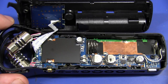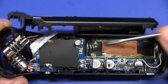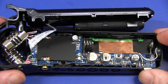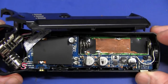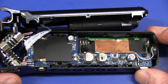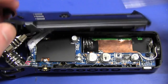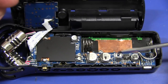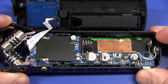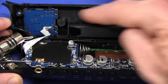Now that's rather interesting. The first thing I notice is this copper shield on top of this board. It's soldered at a couple of points down in there. We've got a flat flex cable going over to the switches on the back of the unit. It looks fairly compact - they've really jammed a fair bit of electronics physically in here. These tall surface mount electrolytic capacitors fit in this space up along here. And this board here is clearly the DC to DC converter.